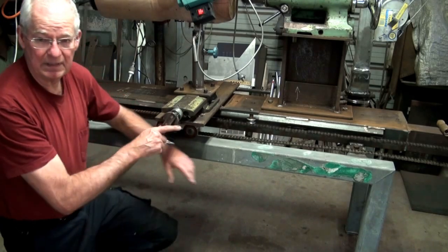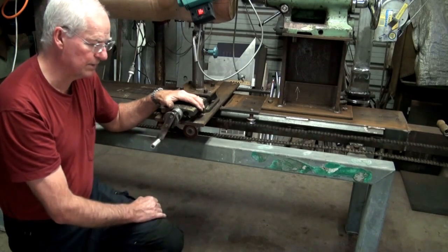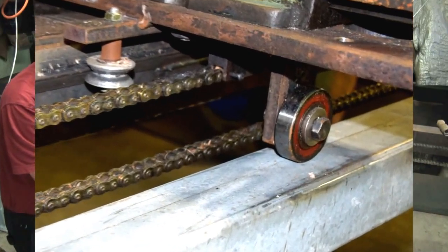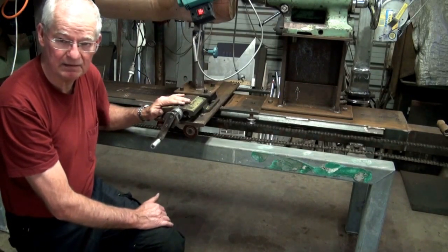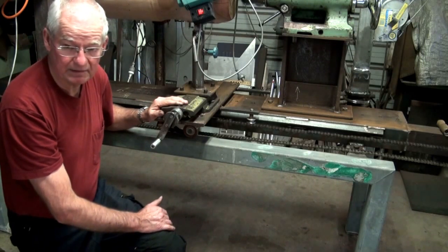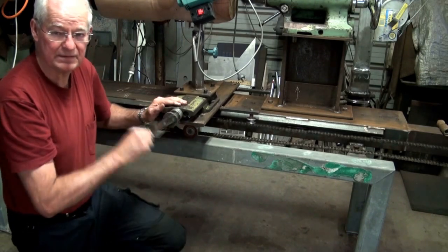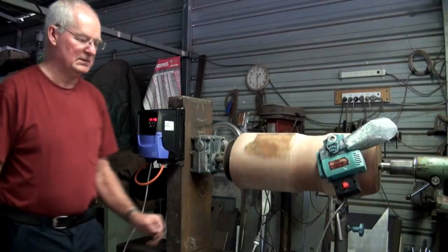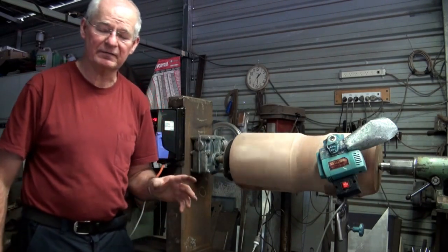We also became clear that all the load from the planer head was directed down through the carriage, and to avoid any problem with deflection we fitted an extra roller underneath which runs across the top surface of the frame. So when we're taking heavy cuts, all of this vertical deflection is taken by that roller. The planer head is able to track backwards and forwards, and we can move the planer head in and out using the cross slide to take accurate cuts across the full length of the log. We'll now run the planer head and traverse it backwards and forwards a few times just to give you an idea of how that process works.